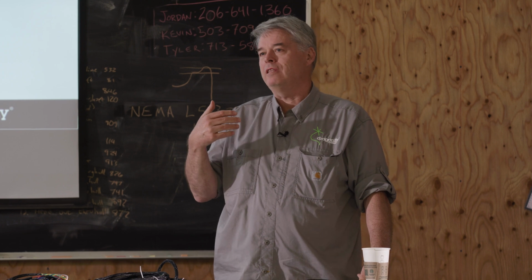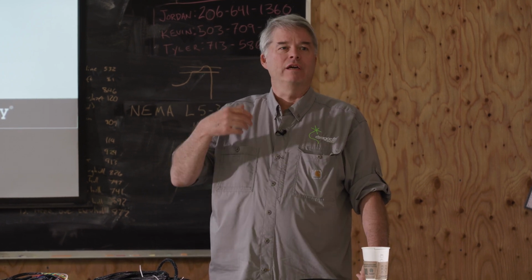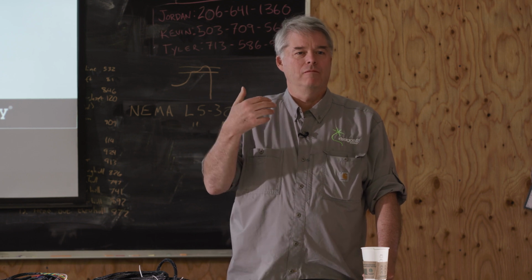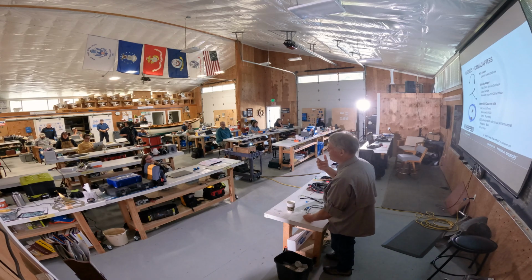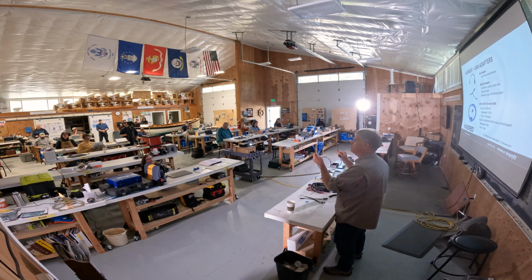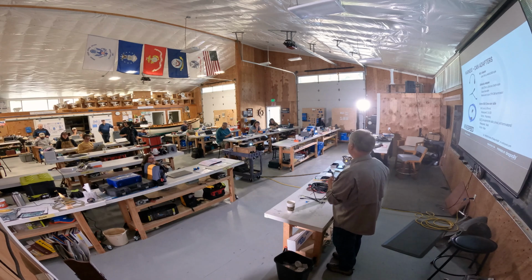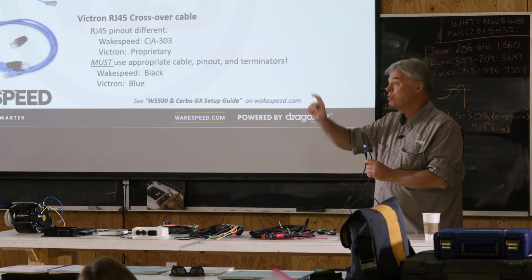Wakespeed chose to use an international published standard called CiA 303. Victron chose to use a Victron standard. Actually, they didn't. There's a beer story about how they got there. But the bottom line is the two standards are not compatible. If you look closely at this cable, and if you go to that Learn tab, there is an integration guide, a little guide on how to do Victron. It calls out the wiring.